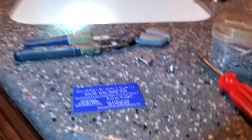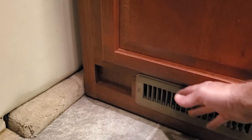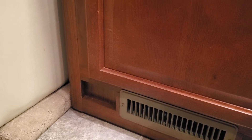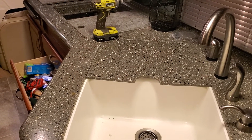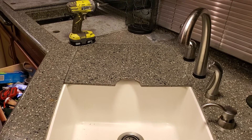The furnace is working just as it should — nice and hot. The heat coming out of the furnace was cold before. I'd hold my hand in front of it, and even while it was burning, you could tell it just didn't sound right, and the air coming out of the vents was cold. Not a problem with the regulator on the tank, not a problem with the orifice. Especially on this 38P, I found some shoddy workmanship where they assembled this particular slide into the wall — must have been a novice. I also had an AC issue with the root of the problem in that same area. Flow through the line was the reason — the line was just getting pinched off.